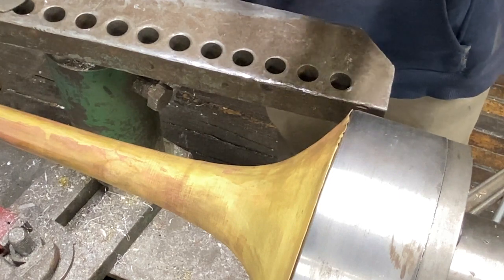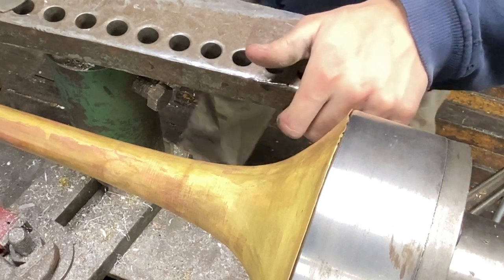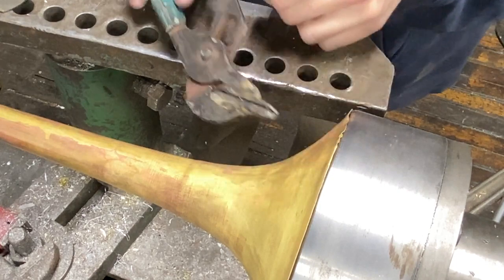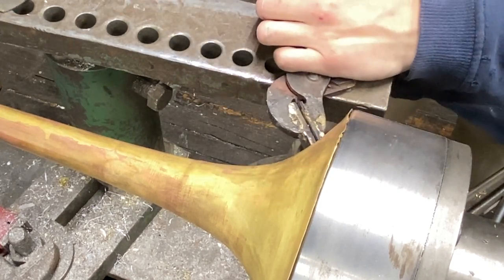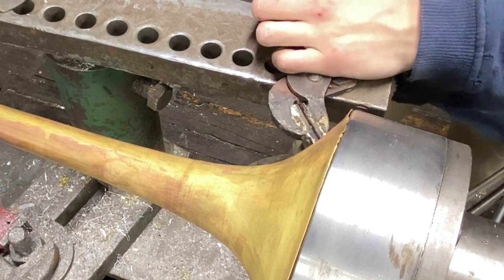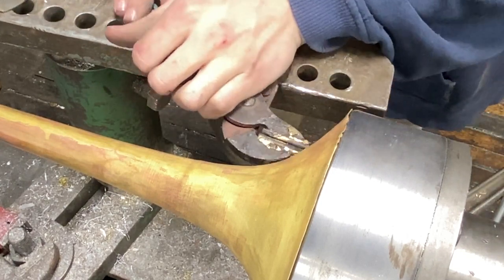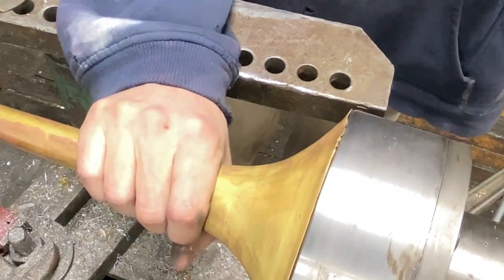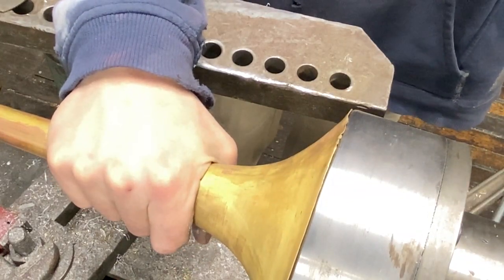This is the shape of the inside of my bead. I put it in there and push it out to fix the faceting. Sometimes there's still a little bit left, and I have these makeshift spinning pliers — I don't fully get how spinning pliers work with my lathe rest setup, but I use these to smooth out the bead if there are any waves. That process has worked so far, though it's not the most exact.